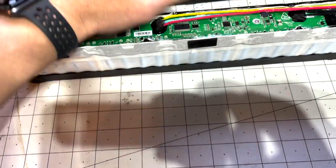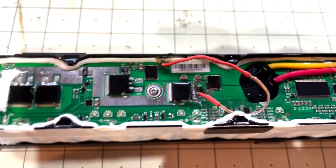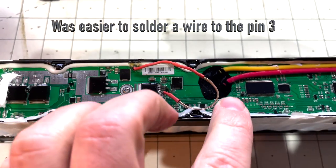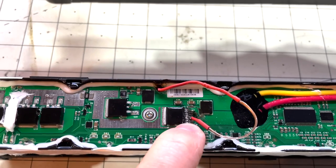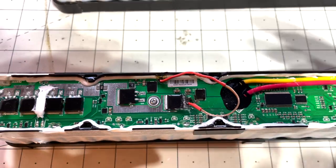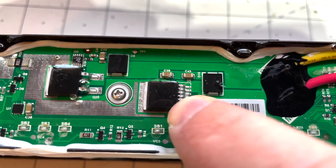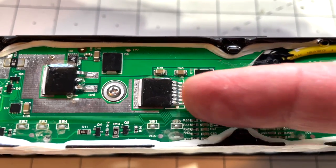I did the hack here — inside this shrink wrap is my 1k resistor. I'm not very good at soldering but it worked. I connected TP7 here, attached a wire, and then soldered to the third pin. I'll put a link to Eric's video. Basically, you use an exacto knife to cut some of the goo around the area — be careful not to short those pins, so use a little plastic tool to remove the goo around the third pin.